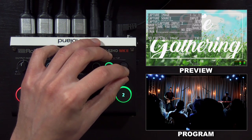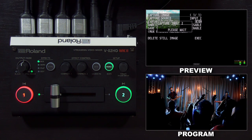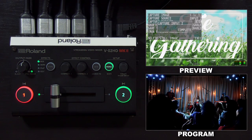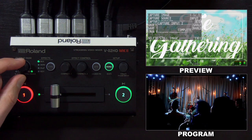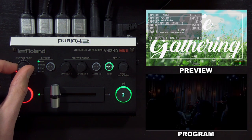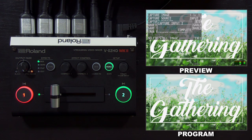Now that I'm ready to capture, I just say yes. It takes about 30 seconds to capture most images, and note that the program output is not frozen while it's doing the capture. Now that it's complete, I can access it using the output fade knob. If I turn this knob all the way to the left, it fades program output to black along with the audio. If I turn it all the way to the right, it'll output the still image.